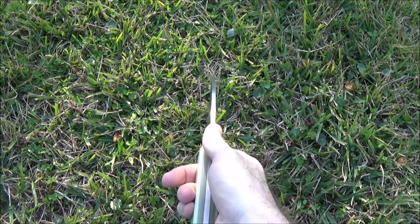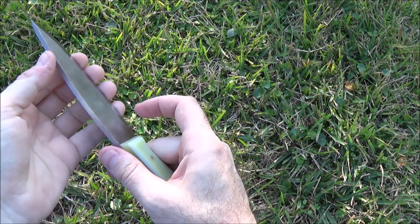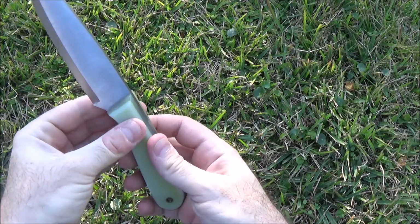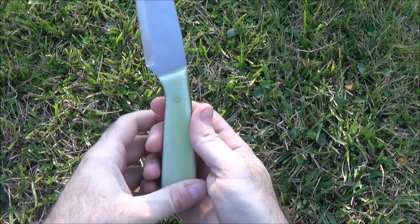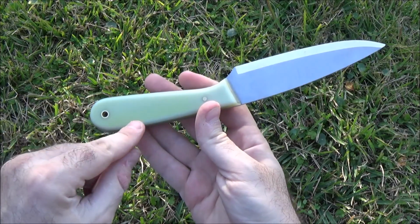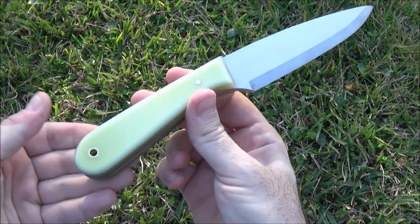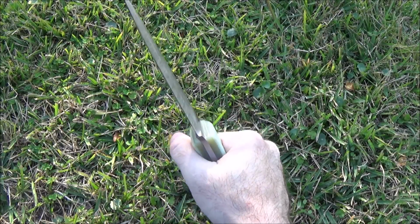Custom-made knife. And I mean, if you add up the time, it's really just a few hours worth of work. There's a lot of time involved in letting the epoxy dry and stuff. Had to do a lot of sanding, so I sanded this from 320 grit all the way to 1000 grit. A little discoloration on the G10 there. That's not my fault, really. Just wasn't a perfect piece of G10, but I really do like the color anyway.